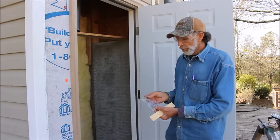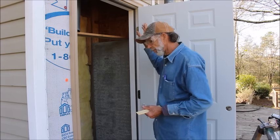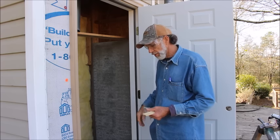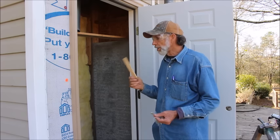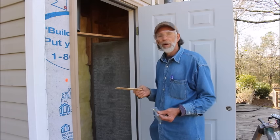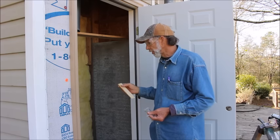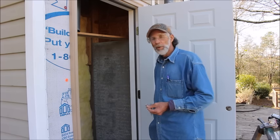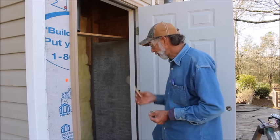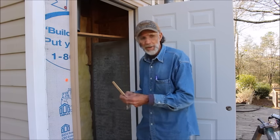In the door came a pack of screws to fasten to the door. Two of them are for the top hinge pins — you want to always put some screws in your top pins. It's not necessary in the bottom one because the weight of the door is pushing in on it. We've got shims, but luckily when I built the door jam I got lucky on this one — it's exactly perfect. I don't have to have a shim in it anywhere because the jam fits the door and the rough door opening perfectly. So I'm not going to need the shims even though I have them.